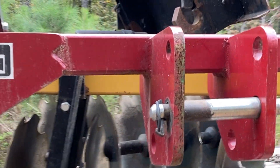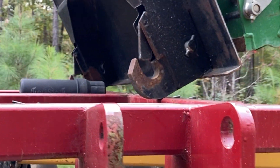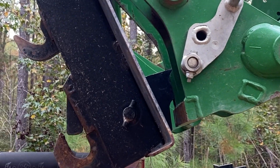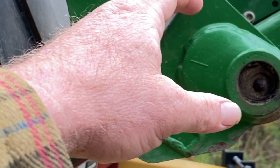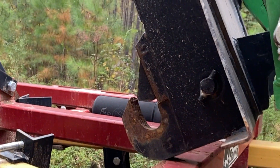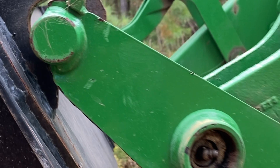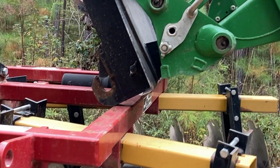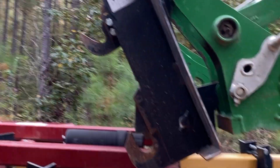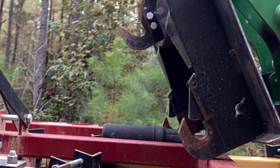What I did is I did not want to buy the high-dollar John Deere Quick Hitch because I was just going to weld this hitch to an adapter plate — that was the idea, so I could pick up everything. What I did is I had the John Deere Global connector on this tractor: you just pull this handle right here and it pulls that rod out. I believe I got this attachment plate from Titan Attachments, which I think is palletforks.com. I've ordered a few adapter plates from them over the years to build other stuff for skid steers. I ordered that — I did not get a real thick one — and then we looked for a cheaper version of the Category 2 Quick Hitch.